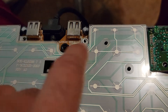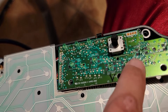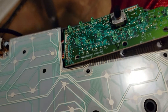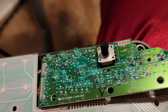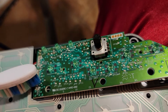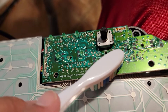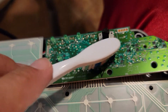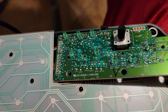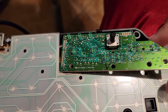There are the grounds right there — I've unhooked them. I could reflow all these solder joints and I have done that on other electronics successfully. Sometimes it's as simple as getting a contact cleaner. There's a certain way to clean the traces on the board, and there are certain switches that you don't want to put contact cleaner in.